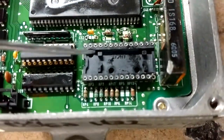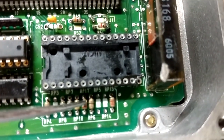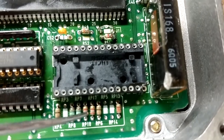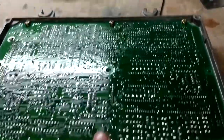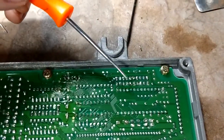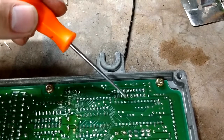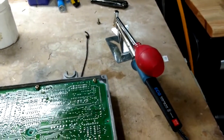The way to do the conversion: if you come down here to the bottom right corner, you'll see all these resistors. Right here there's R18 and R17. What I'm gonna do is remove both of these and do a jumper on R18, and that should convert it. I went ahead and took the back cover off and located the two resistors that need to be removed. I already desoldered them — you can tell by the little black dots, there are holes where they were.